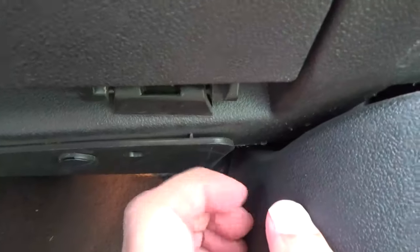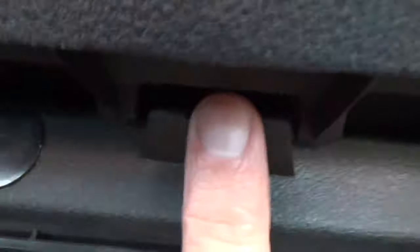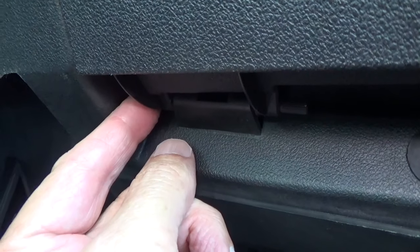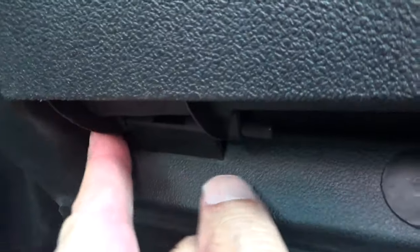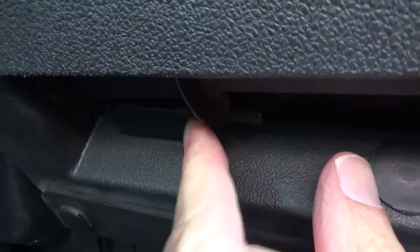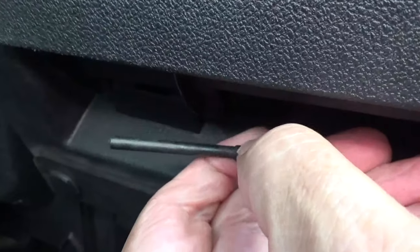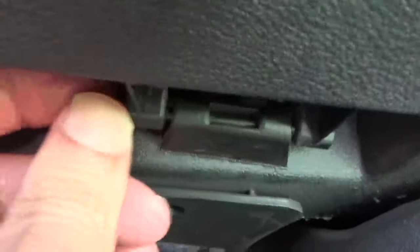You can do that by removing the pins at the bottom — there's one there, and one over here. You need to start on this side with a flathead screwdriver or needle nose pliers and push the pin over so it starts to stick out on the other side. Then you can just pull that pin out with your fingers or with needle nose pliers. I'm going to take this other pin out as well.